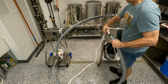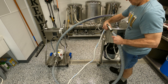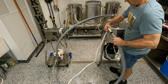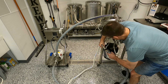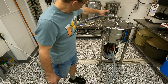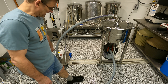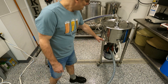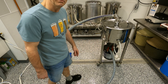That'll help prime this thing a bit — you can see water coming out of the ball already. Alright, we'll see how this works. We have everything hooked up: we've got an elbow on the top going to the CIP ball inside. That's hooked up to the outlet of the pump. The inlet of the pump is going to the bottom of this bucket, which will serve as the return — we'll just use that as a sump and keep recirculating. Anything that splashes out of these two holes here is going to go back into the bucket as well.